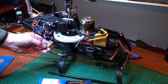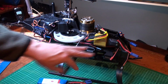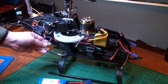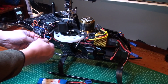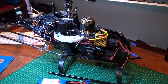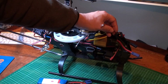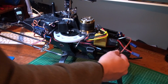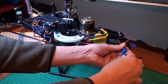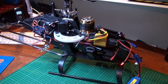So I swapped this. This has a little switch, PPM, meaning it will let through the signal just as if this wasn't here. IRS will turn on the receiver for IR. Do note that I have this little LED connected here now, so when I do programming, this is my feedback, so I know what happened. If I connect the pack right now, it's gonna light up here, and that means it's in programming mode.